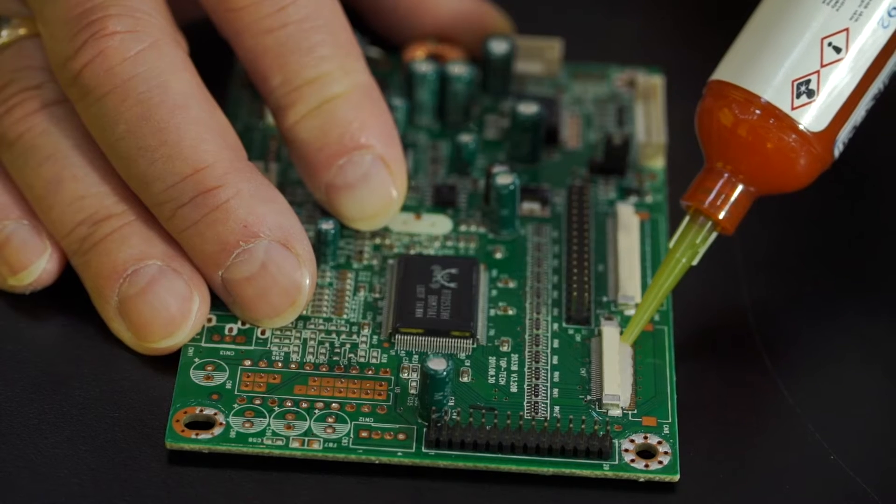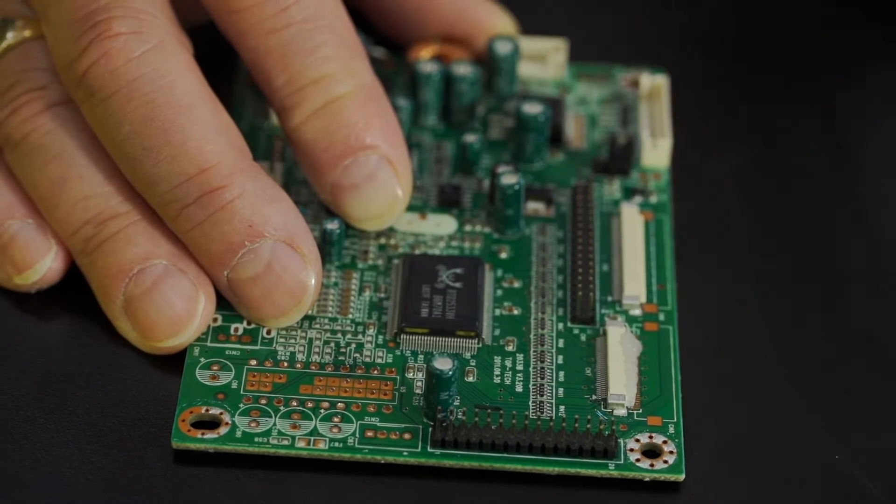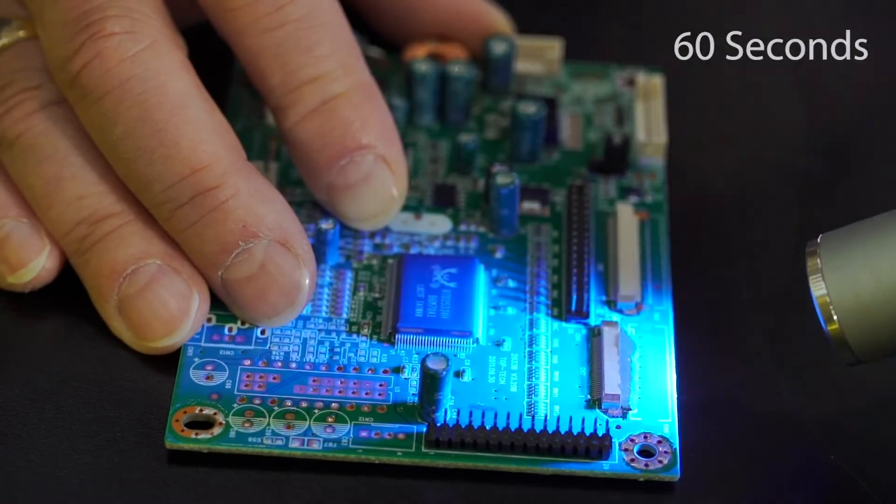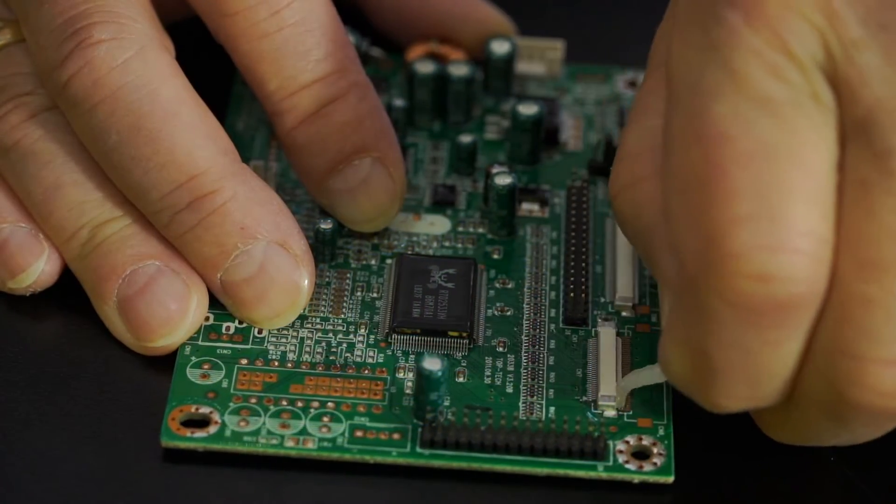We've developed a UV curable polymer that's curable with black light, with long wave UV light, in one minute. The reason we've developed this is that normal latex masking will take anything up to two hours to dry. A lot of wait for PCB manufacturers and PCB assemblers, which means money held up. With this, they can cure it instantly and go on and comfortably coat the board.